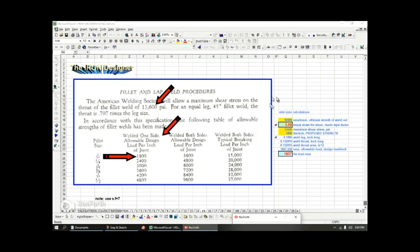So what they said in this book is that the maximum shear stress, because many welds are under shear, okay? And normally you would take something like half the yield strength to compute your shear stress. But here in welding, they have their own numbers, and weld engineers have their own numbers. And the textbook says that if you have a 50,000 PSI max ultimate strength of the weld rod, then you should immediately have a knockdown factor of around 3.7, and your maximum shear stress is going to be around, say, 13,600, right? The lower you bring that down, the more conservative you are. If you're designing at 13,000 PSI, then you're more conservative. Your knockdown factor is nearer to 4, okay?